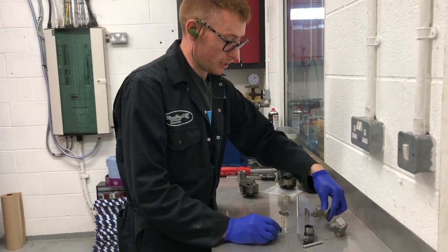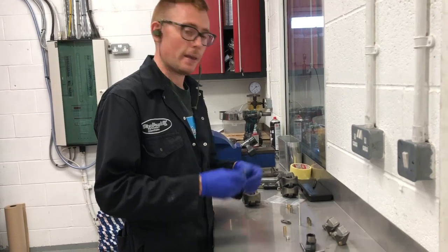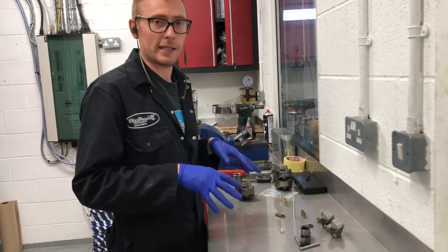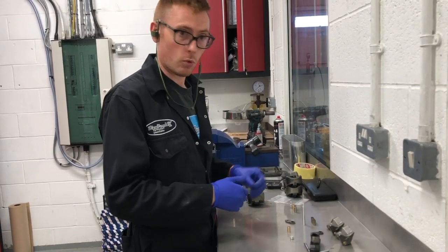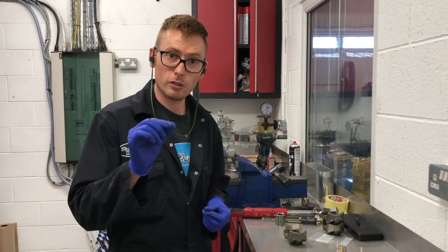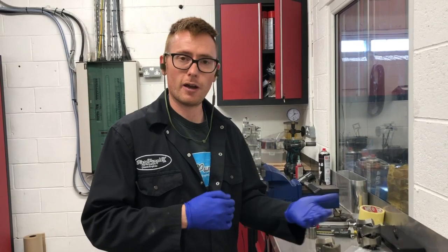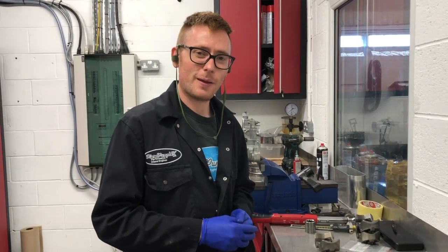That's what we do, and if you've got issues of that nature then this may be a fix to resolve it. In time, I may sell this as a kit — like a governor repair kit. I'm trying to make all these things more accessible and more possible for people to do. Things like this that aren't actually available for sale, we're slowly making them and producing tools so pump builders and others can use them. Just a little bit of insight into the flyweights and the governor system and how it works. At a later stage, I'll go into more depth about the special equipment we've made to help phase these pumps, because we've had to simplify that process as it was quite antiquated. Just little bits — I'm giving you little bits.